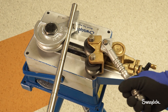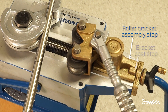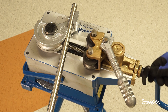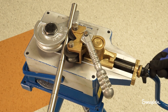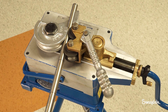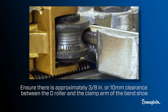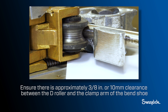Turn the roller bracket lever clockwise until the roller bracket assembly stop makes contact with the bracket post stop. Hold the tube and turn the roller knob clockwise until the G and D rollers both make contact with the tube and the roller knob is tight. You may need to guide the rollers onto smaller diameter tubing. Ensure there is approximately 3/8 inch or 10 millimeter clearance between the D roller and the clamp arm of the bend shoe. You can place a piece of white paper underneath the rollers to help see the gap.